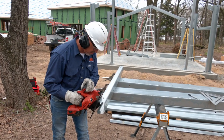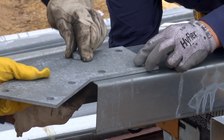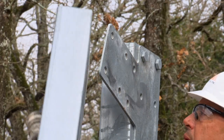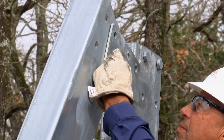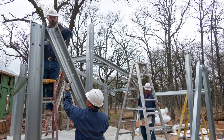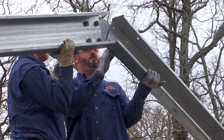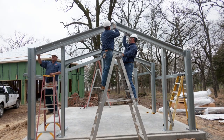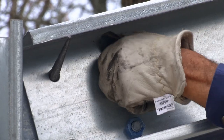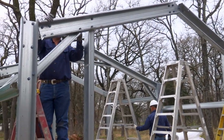Referencing your drawings, locate rafters and apex brackets. Install the apex bracket on the peak side of one rafter in each frame line. Ensure that the rafter is oriented correctly. Lifting the haunch side of the rafter, attach the rafter to the haunch bracket with one bolt in the lower outermost hole. This will leave the peak end resting on the concrete. Follow these same steps on the other rafter in this frame line. With each rafter now secured at the haunch with one bolt, raise both peak ends of rafters up and fully connect them to the apex bracket. Install the remaining bolts in the haunch bracket connection. Bolt knee and apex braces into place. It's important to not leave frame lines unbraced. These can be secured with chains, straps or roof purlin.